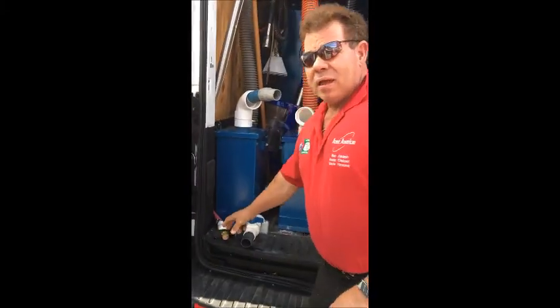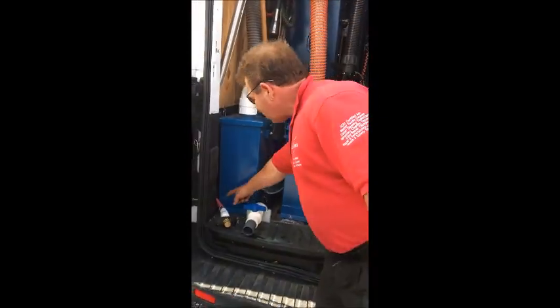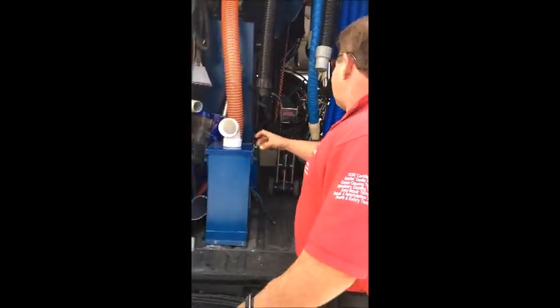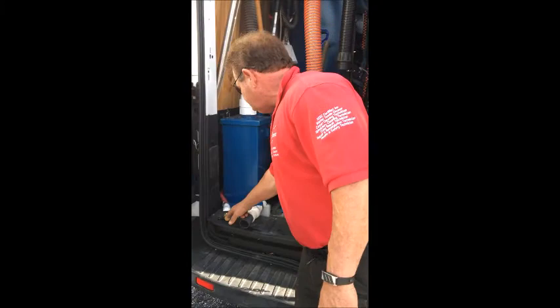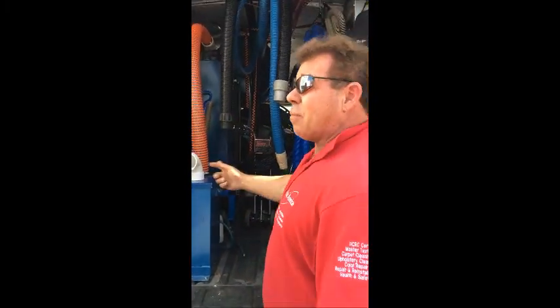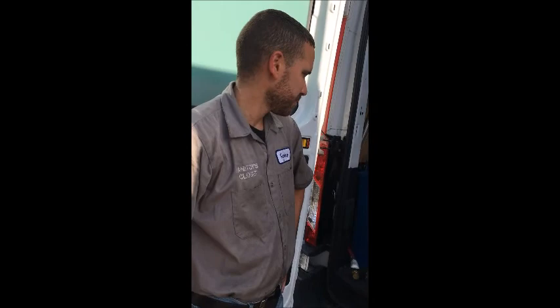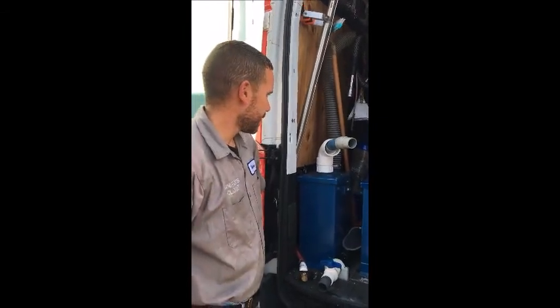One thing about this pump-out — it's a constant flow, not pulsating. When we tested it and hooked it up, it's constantly squirting water about 10 feet away. He restricted it for this size hose, but with a bigger hose, it dropped me to 48 gallons a minute — and at 48 gallons, the other pump-outs would fill up the tank before they ever finished. With an inch-and-a-quarter line you should reach maximum discharge of about 4,000 gallons an hour. That is a lot of water to move.